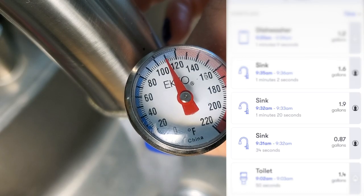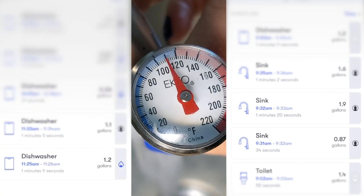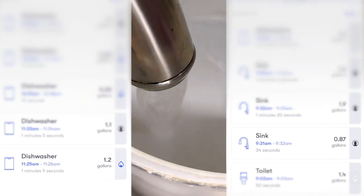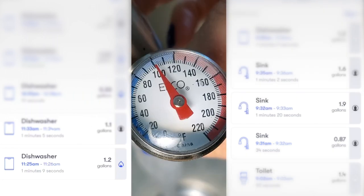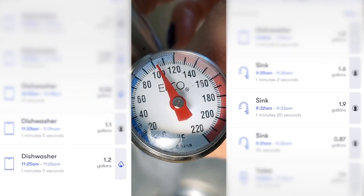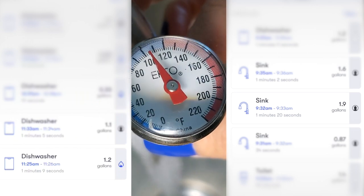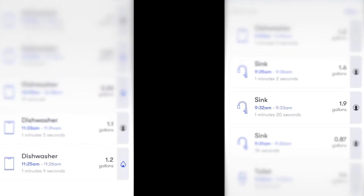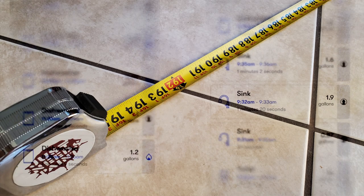You can compare that to the first 1.2 gallons that comes out in 1 minute and 8 seconds of a dishwashing cycle. That first 0.87 gallons for 34 seconds was me filling up the Brita filter, and the follow-on 1.9 gallons in 1 minute and 20 seconds was getting a steady reading after watching the temperature gauge go up. So you can see, if I'm not pre-charging the line, hot water will never make it from the water heater